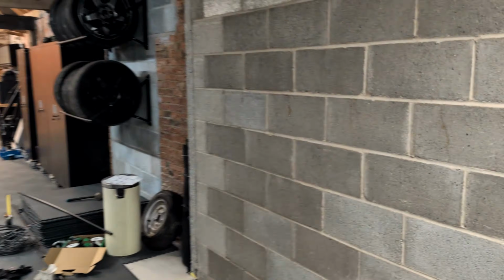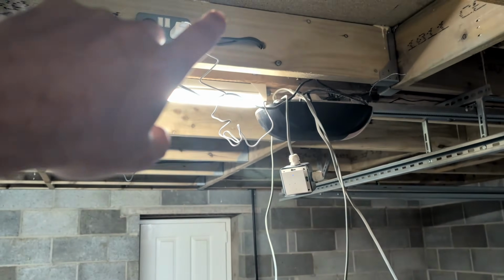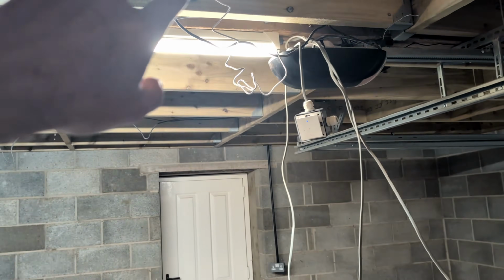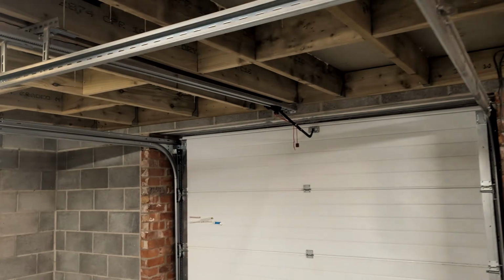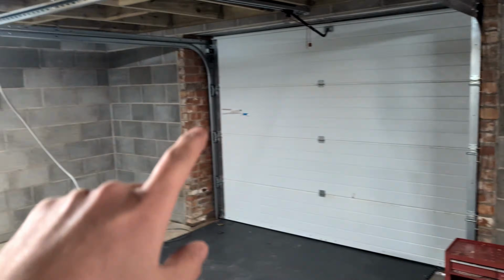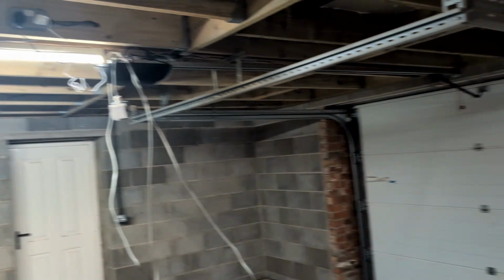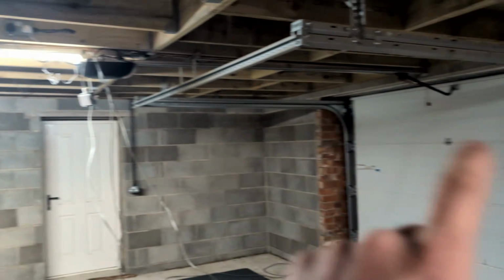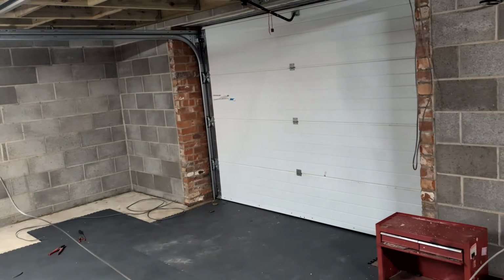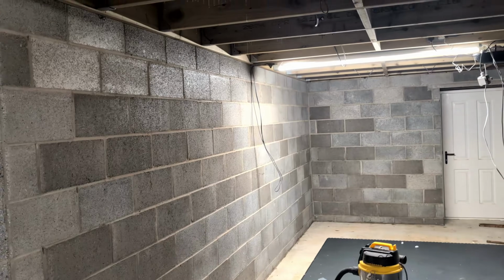We've got electricity, and I also tidied up the socket up there for the door opener, which again will be above the ceiling level. I think I'll add a little inspection hatch in the ceiling so I can get to that if I need to in future. So the job for today will be to isolate the lighting, get this door open so I've got some natural light, get that batten rewired into my new wiring, get the switch moved over there, and then rip all the mess out. And then hopefully this area will be good for paint, and then subsequently putting a ceiling up.